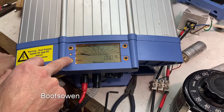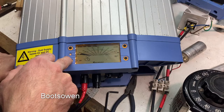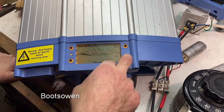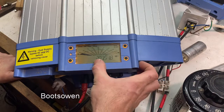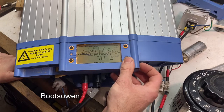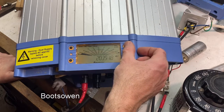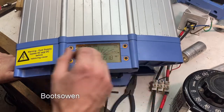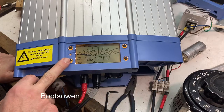I'm guessing that 100 is if you're doing 3300 watts coming out of it. Actual day total: 20,351 kilowatt hours — so this machine is probably just decommissioned to upgrade or renew a system. No smoke coming out of it and it's not getting too hot. Going through the display: actual today, yesterday — we can run back about a month. Total hours: 50,194. Total kilowatt hours — so that's how much it was in the sun. Running for basically 50,000 hours and putting out 20,000 kWh, so it was running under half a kilowatt most of the time. System, sleep, England, model, serial, firmware. No errors.